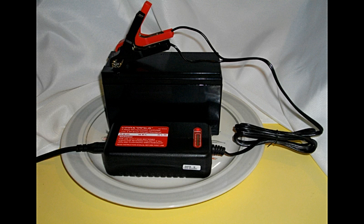I purchased a special charger on eBay specifically designed to charge AGM, gel, and SLA batteries. It is made by VMax Tanks, model number V12-3.3, sells for about $40, and is a four-stage fully automatic smart charger. Don't be fooled by similar float chargers on the market — what you need is the four-stage smart charger so you can top your batteries off on house current before you hit the woods.